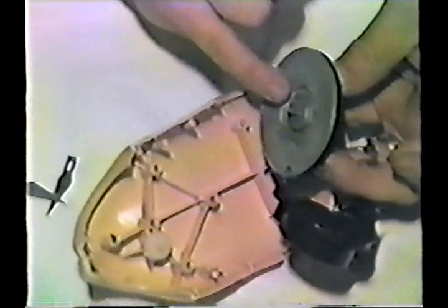We'll remove the old O-ring. This one does not look greasy. The O-ring was just old and worn out. There is grease on this spindle point, so when you put the new O-ring on, you need to be very careful not to touch that with the O-ring, or else you'll get grease on your new O-ring. You don't really want to wipe that grease off unless you're going to put some Vaseline back on it.